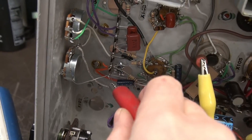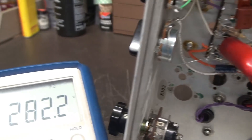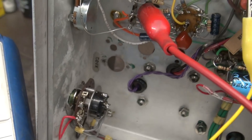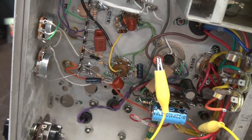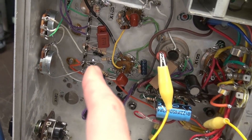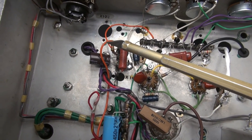Let me grab this lead and go to the 12AX7 — we're also at the same screen voltage because I haven't put in the dropping resistor and additional cap for the 12AX7 circuit yet. So the next thing I'm going to do is put a terminal board here, swing some wiring with another resistor and a cap to feed the 12AX7 100k resistors. There's the new terminal board, screen resistor, and a little 10k resistor with a cap that feeds the preamp section.